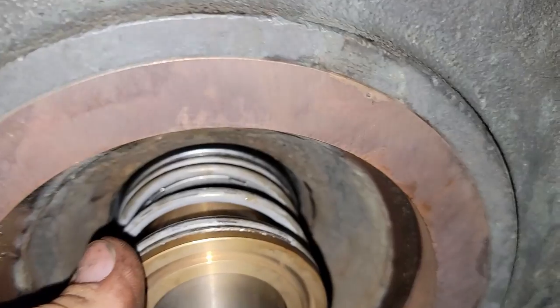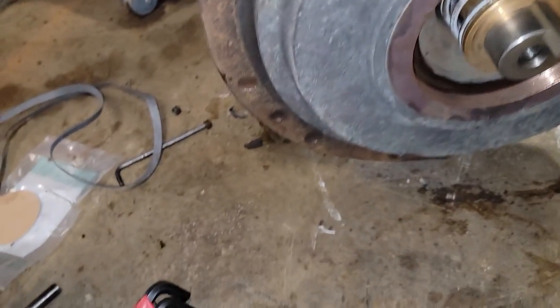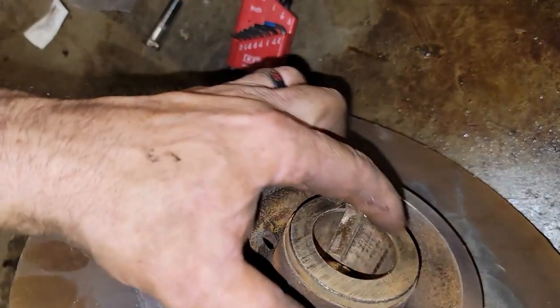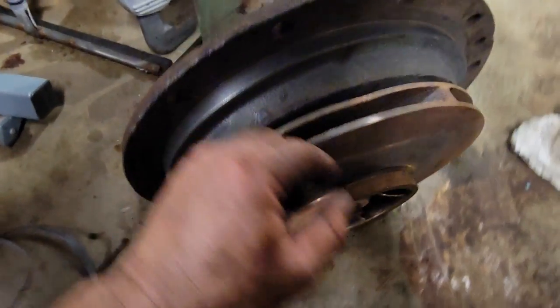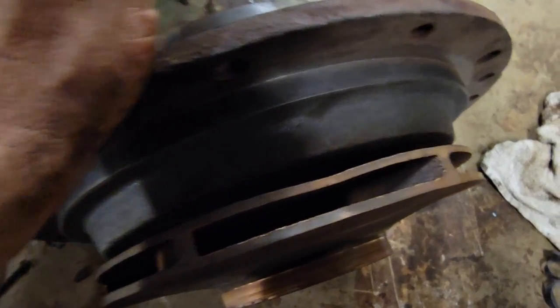The other one slid right off — this one did not. Got it on there, all the way up against the other one, mating surface against it. Now you've got the set key here — this comes on the back side and matches up against it. Now you've got that o-ring, or square ring as I'm calling it because it's square — it goes on the end right there and seals it against this piece. Got that on there, tightened it up by hand with the wrench, used my crowbar wedged in there so it wouldn't turn. Be careful — you can see what the last guy did when he was prying this off; he bent that, which could cause problems with your bearings.